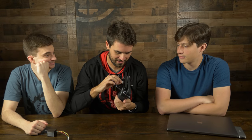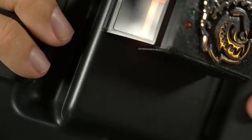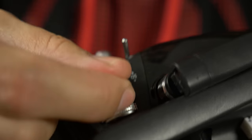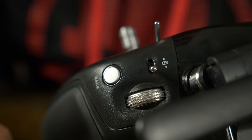That is really slick how you built a port into the radio. That looks like it was there. Yes. And it receives power from the radio. Okay, so there's no other battery in here? Nope. So I told you I use this switch for arming. Yes, you gave us very specific instructions. I'm very particular about my arming. This is for my drone. I want it to be unique to me. So we've basically hotwired the switch and interrupted it so that if you flip it to the arm switch, it's not gonna send a signal to your controller unless the fingerprint has been activated.